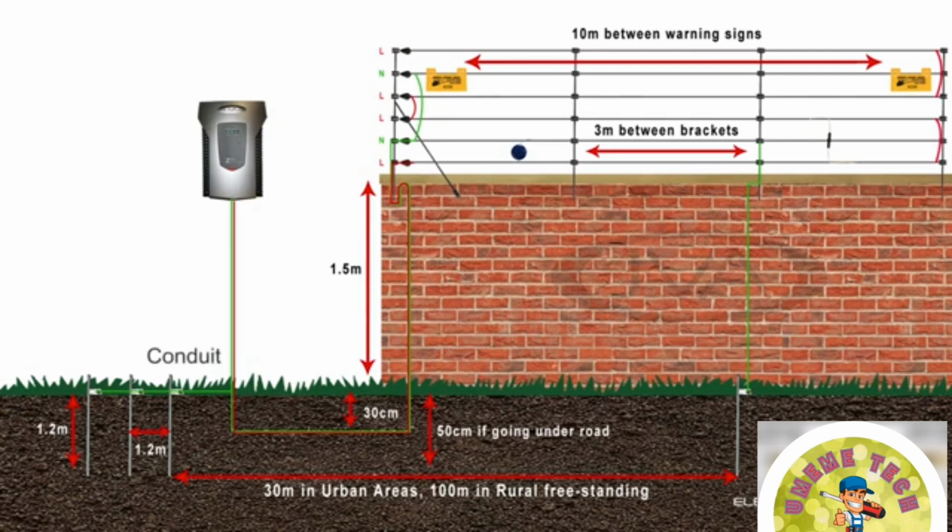All the undergate wires are to be run through protective conduit piping. The conduit needs to be sealed at the top by the wall to prevent water and dirt from getting into the protective piping and deteriorating the wires. Also make sure to use conduit on all the intermediate earthing wires down the fence as well.